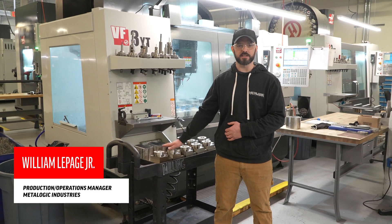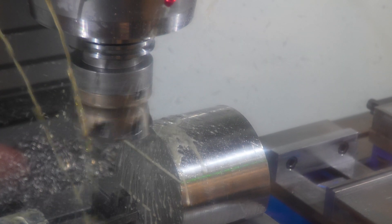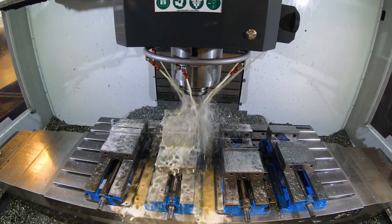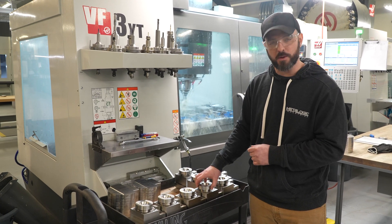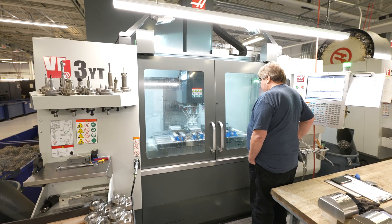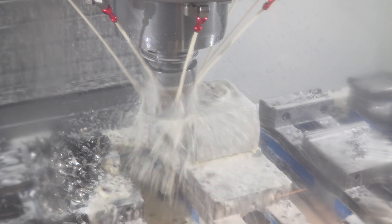This is the part that got us into five-axis machining. Here we're in our 50-taper machine cell. Here you'll see the first stage — we take a round bar and we square and cut all the edges to give us a real rigid, secure work holding. We flip the piece over and here we attack it from as many sides as possible, removing as much material as possible. We have four and six inch face cutters and high feed mills, really aggressively getting this material off. This is 316 stainless steel — very challenging application and tight tolerances.